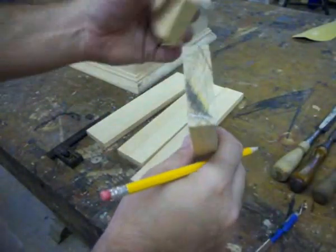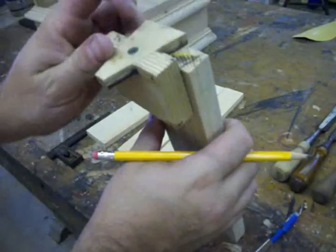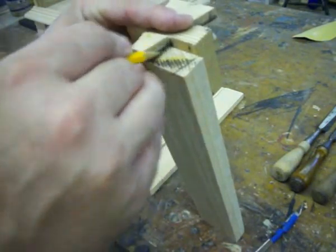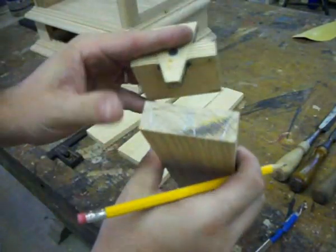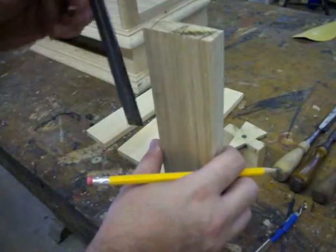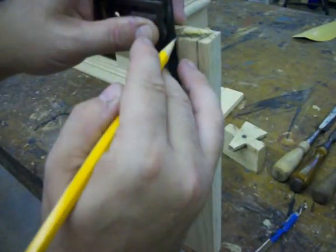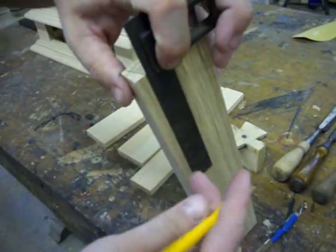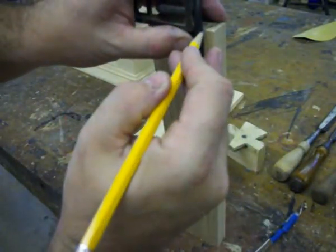You can see how nice this little gauge helps out. You don't have to use a bevel square and set it for the slope angle that you want — it's already done. I've had this thing for probably ten years and used it for every dovetail I've cut. I like my pins real small; it makes it look for sure like a hand-cut dovetail. Now these lines I'm drawing straight down here are the most important lines to go off of when you're cutting. The angle can vary on the edge of the board, but your saw cut needs to be straight in line with these lines. That will keep everything lined up and give you tight-fitting dovetails.